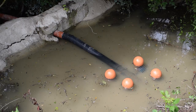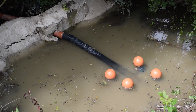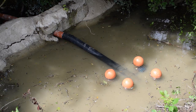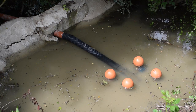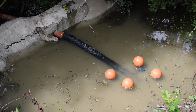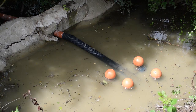The manifold's on and the pond's filling up. We can see the advantage of having a floating manifold — the floats keep the filters just below the surface level, which protects them from floating debris. Depending on the depth of your pond, it should keep the filters off the silty level below. Stainless steel guards will protect the filters from fallen debris or extreme storm flows, and the manifold will now provide screened water for the system, keeping your pump healthy.